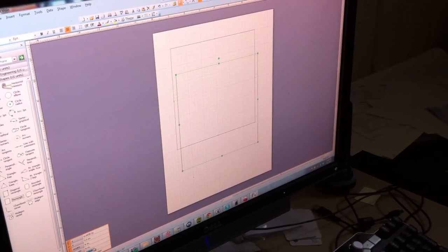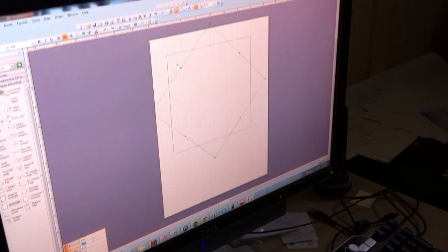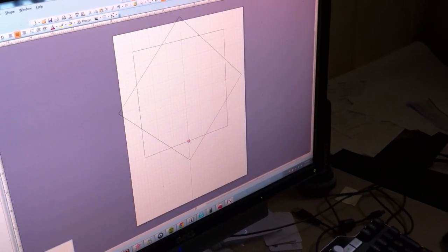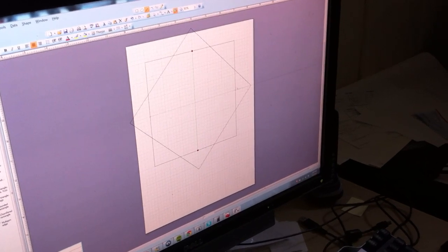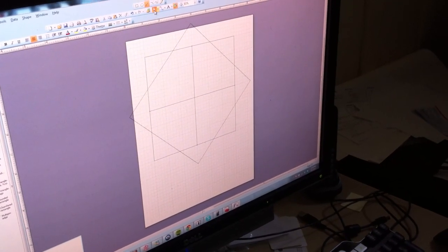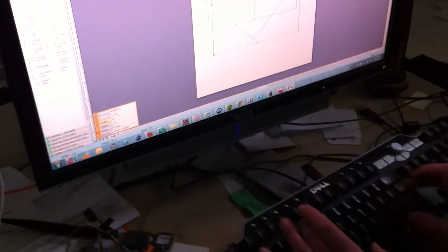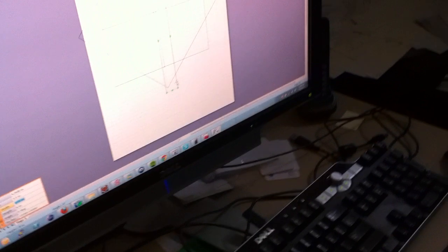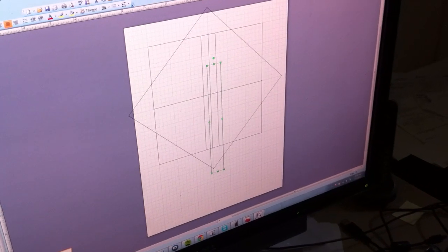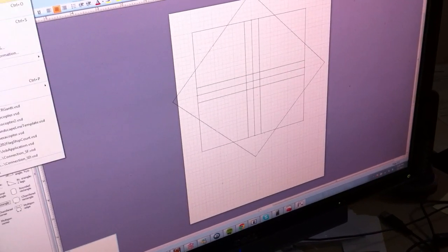Now the other part we just rotate 45 degrees, position it in the same spot. Okay, perfect. So that's basically 2 6 by 6 inch squares. Yeah. And now these are going to be the center lines. And now I'm going to do another rectangle for the arm, so that will help me to easily glue, so that the arms are 3/4 inch, so 0.75, and we just move that into place. The horizontal one, so that's 90 degrees. Okay, now we're ready.